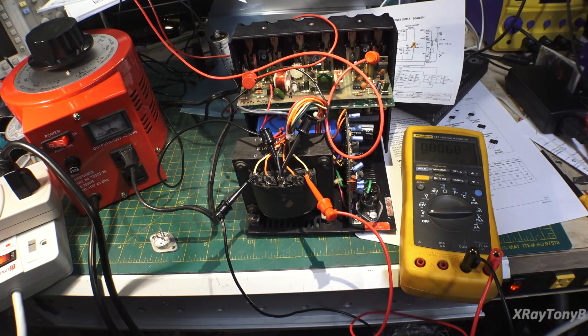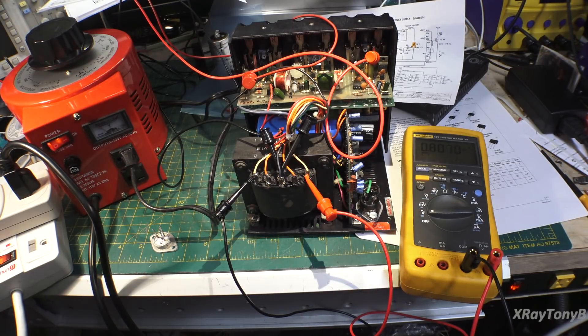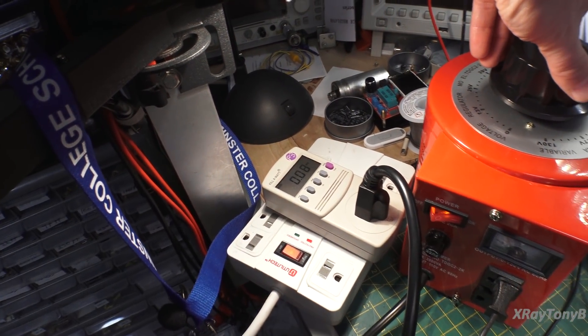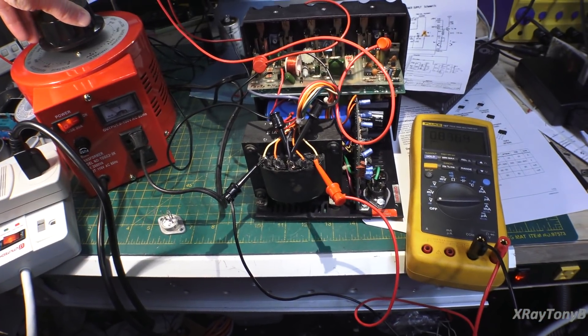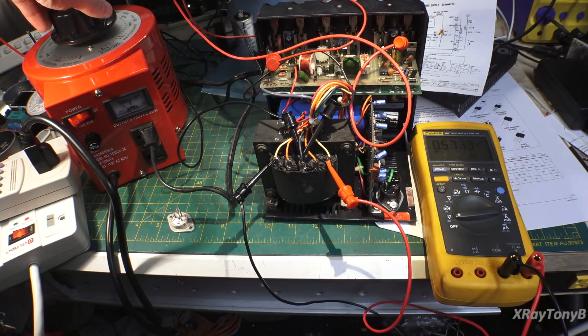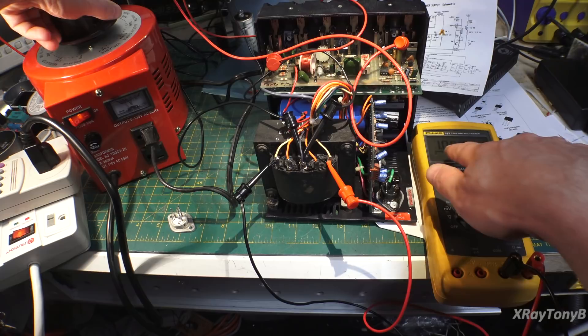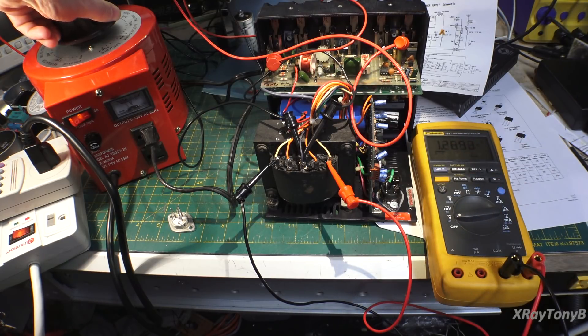I did some static checks and I don't see any shorts anywhere that I could see. Nothing left to do but to turn this all on and try it out. I'll put that on and we're going to start turning this up. You can see nothing on the amp meter for current. We're going to start turning this up and we should start to see something come up on this meter. Once it starts to fire — there it goes. We have one volt AC, drawing about 100 milliamps of current. Let's go up a little more — it just jumped hard. Now we're at 40 volts. That means the TRIAC is actually firing this transformer, and we're still only at 180 milliamps.